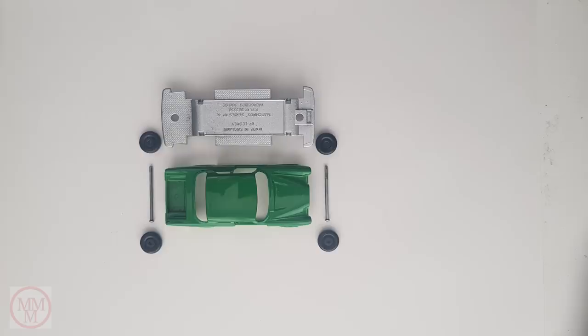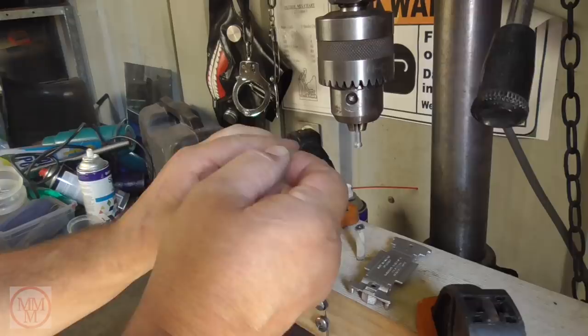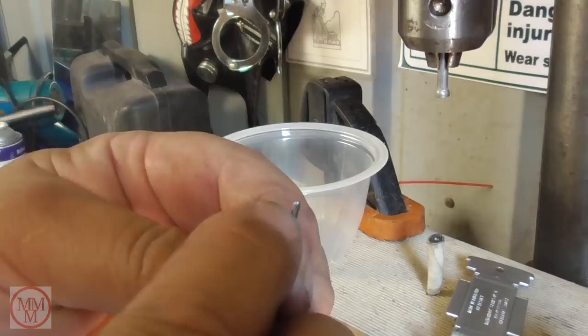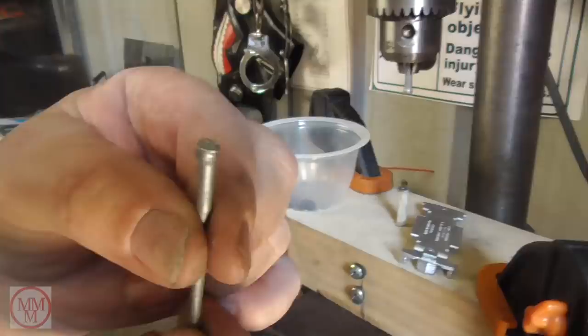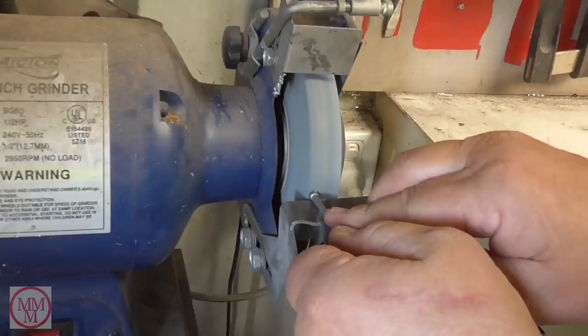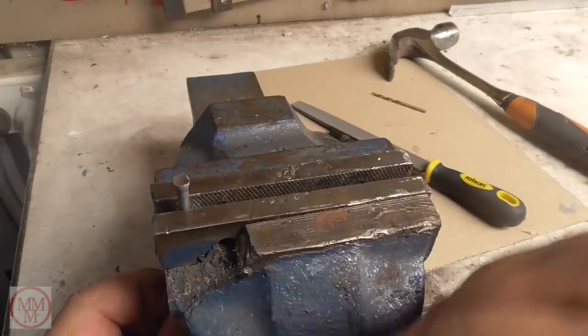Here are all the parts now that have been rejuvenated and are ready for assembly. First off I have got to put the wheels back on the base - I do this in my shed. One end of the axle is original and is mushroomed; the other end I wore down with my Dremel to remove the wheels. I now have to reform them using a tool I have designed in my drill press. I am going to show you how I make one using a Commonwealth Garden galvanised nail - first I grind the end down so it is relatively flat on my grindstone, then I place it in my vise and using a hand file I finish off the top and try to make it as horizontal and smooth as possible.